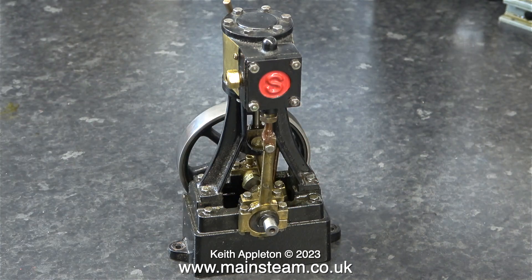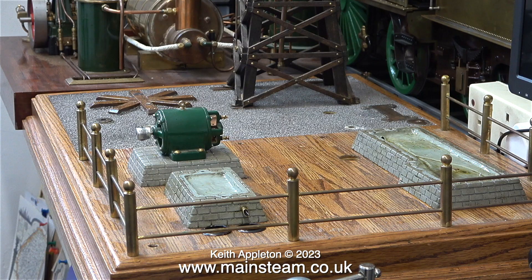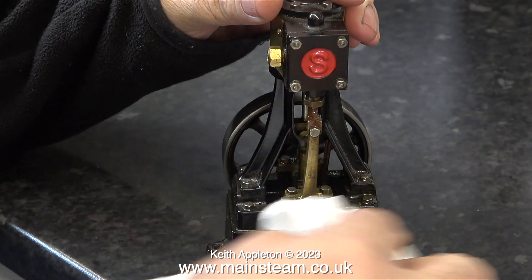The draincock pipes also fed into this area. I'm doing away with that — I don't want any draincocks on this engine. As I mentioned earlier, I just feel that they are so unnecessary on small engines, and besides which, they also usually leak and dribble anyway.